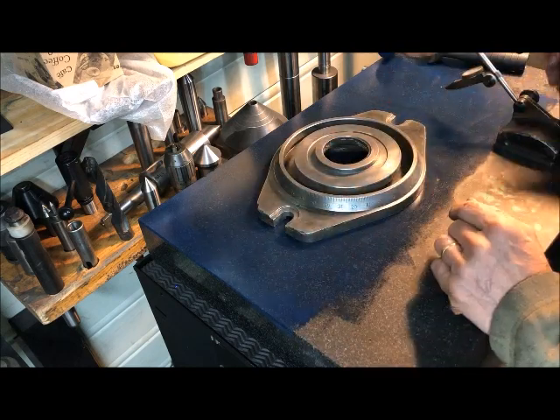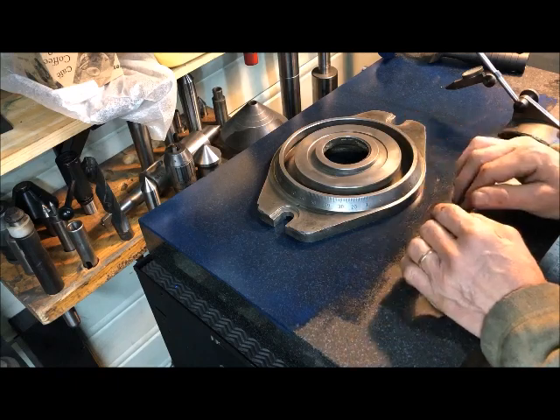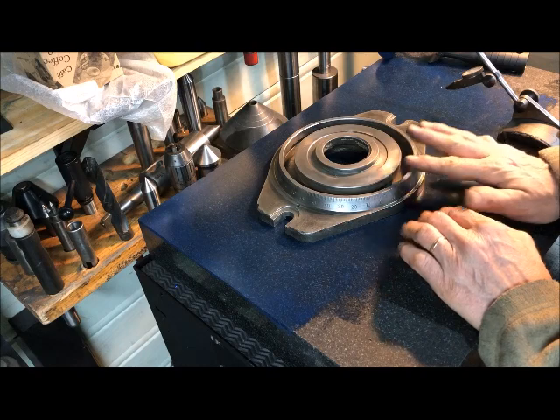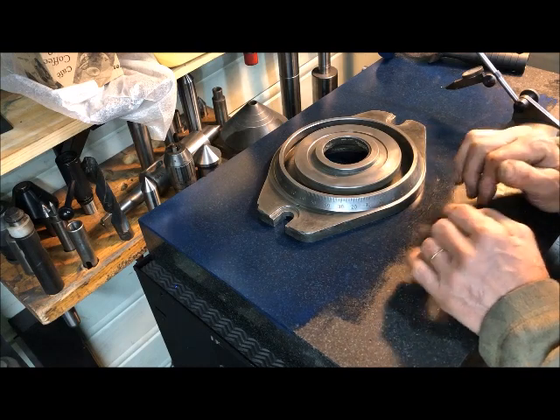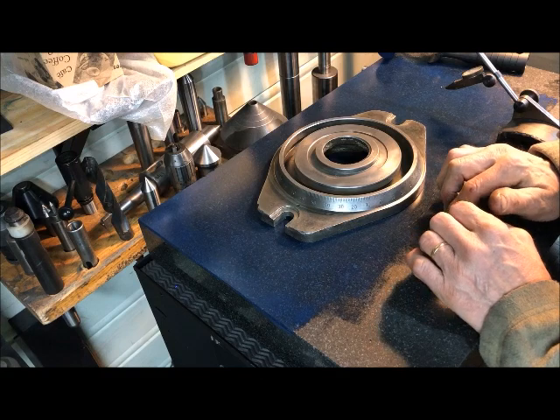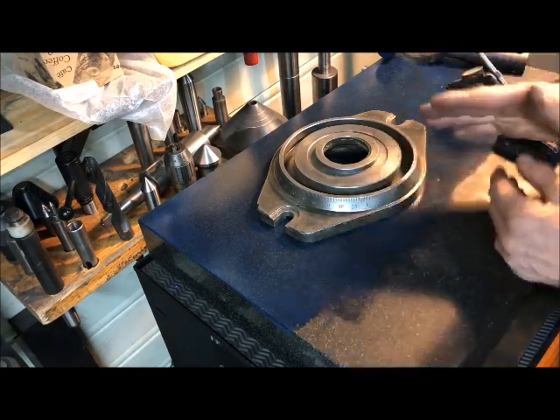I tried here and here, but there is no bore here to relate to — everything can be worn. But if I get it within hundredths of a millimeter, I guess that's within reason. It's half a thou, so that should be okay enough. I don't know if it's ever been that accurate either.